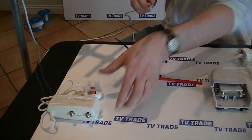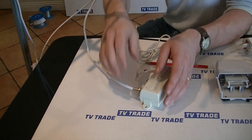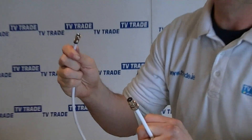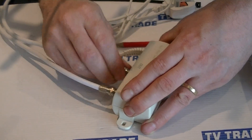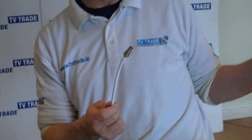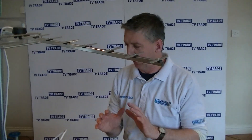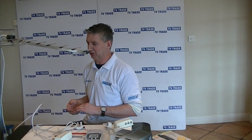We'll take the simple single-input one here. I screw on the F connector and then the final step is to come along with another pre-terminated cable — this one has an F connector on one end and a coaxial connector on the other — and run the cable directly into your Saorview TV or set-top box for the digital Irish channels. That's it — it's a relatively straightforward process. The purpose of the video is just to give a demonstration of how this would be successfully installed. Most people won't need it, but there are lots of locations in Ireland where this would be absolutely essential.